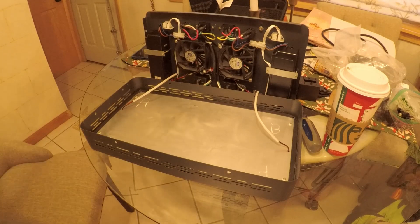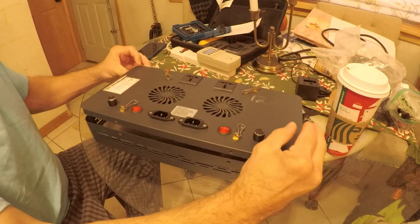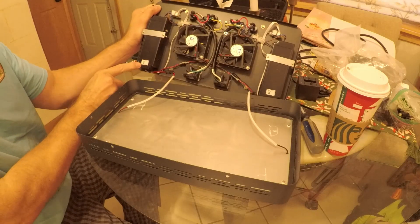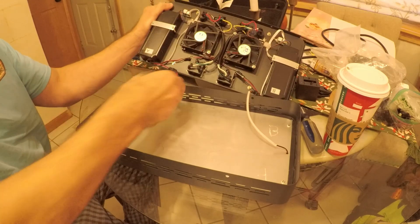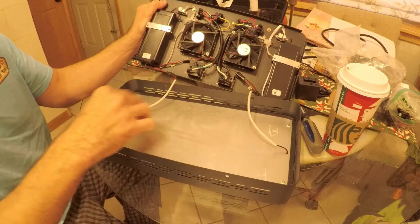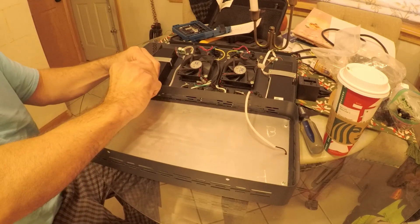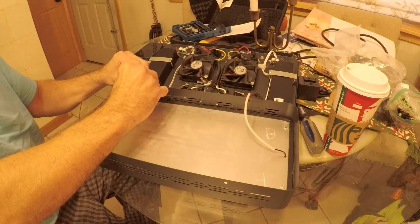I went ahead and removed the screws — just Phillips screws you back out from the casing, and this just pulls up like so. In regard to the white channel on these Mars Aqua LEDs, I already know it is the A channel that controls the white LEDs, but the easiest way to test this is when you have the white channel on. There's a wire that goes from the LEDs to the driver box — just a little push-pin connector — and if you disconnect the connector, that's the easiest way to test which driver box is driving the white LEDs.